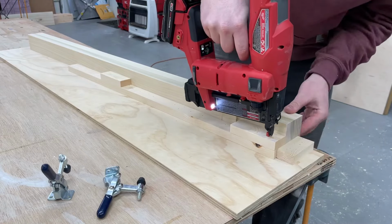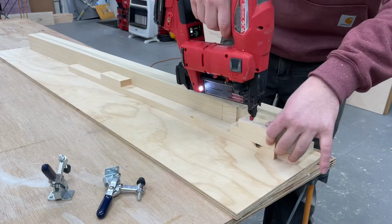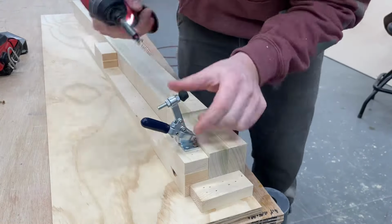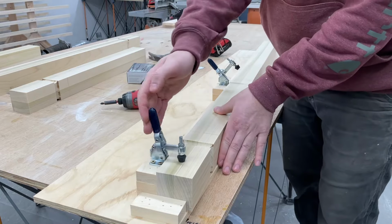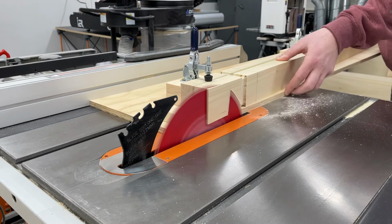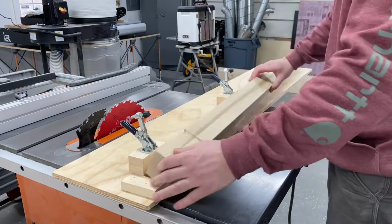For the clamps I used, I then had to add a couple more blocks to build it up so they'd be close to flush with the legs. You can build some pretty fancy taper jigs, but this one literally took 3 minutes to make and it worked great. Afterwards I can just pop the brad nails off and use it for something else. With the jig done, I could then run it through the table saw, leaving the fence where it was when I initially cut the plywood so it cuts right on that same edge.